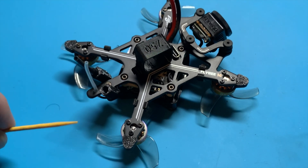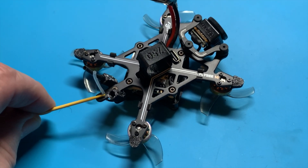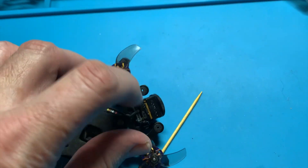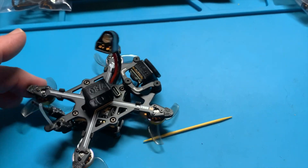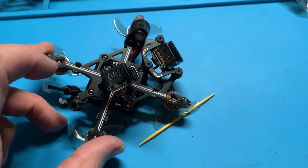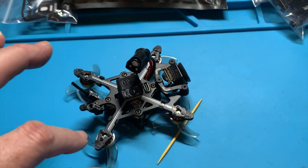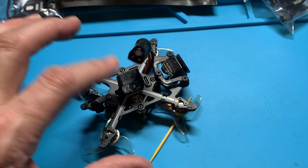Since I'm a slow, lazy old guy, I'm going to try and make this upgrade as simple as possible. First I'm going to push the Express LRS antenna through the hole that mounts it in place. Then I'm going to attempt to use a toothpick to push the rubber grommets through the top plate frame that hold the camera in place without disassembling it. Then I'll remove the TPU mounting screw that holds the O4 VTX antenna in place, remove the three screws on each of the motors, and lastly remove the four top plate frame screws.